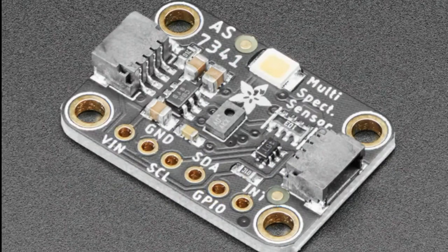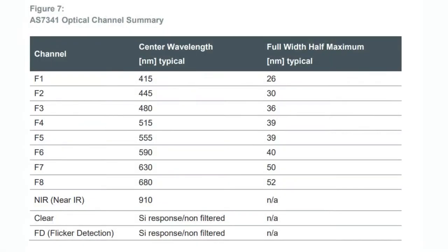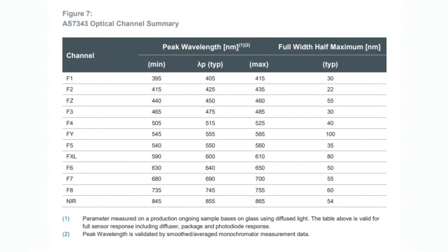The previous version of the sensor — the reason I was excited to see this is we've stocked the AS7341. We designed this two years ago, and this sensor, you can see here in the middle, has — I think it was called an 11-channel, but really it's eight different colors, and then clear, flicker, and then I think clear minus near IR or something. So it's basically eight-ish channels of color spectral sensing — way more than the three you normally get: red, green, blue — plus orange, near IR, something more violet. These are the central wavelengths of each channel, going from 415 nanometers up to 910, and then clear and flicker detection are separate.